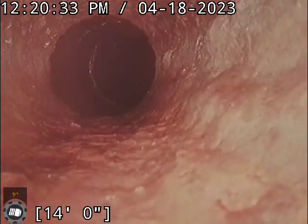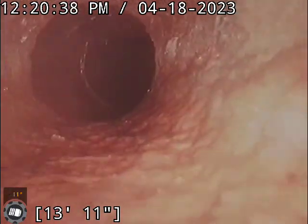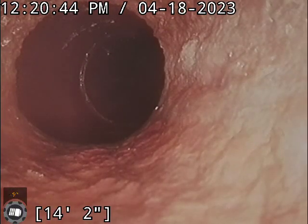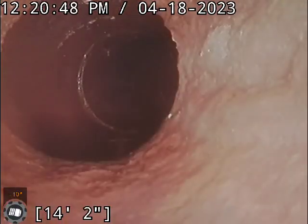All right, so now this is underneath the house, okay? This is the cast iron pipe underneath the house, okay? So this is called a 4x3 transition. Basically it's a 4-inch ABS plastic connection to a 3-inch cast iron pipe, okay? So it's 3-inch cast iron pipe inside the house. All right, we're gonna pull back.